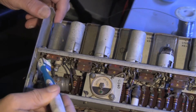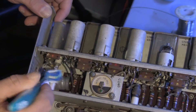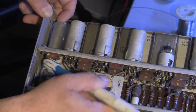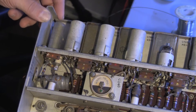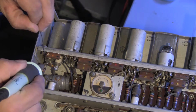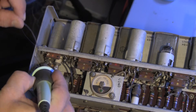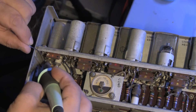I'll start by cleaning some of the dirt off of the contact I'm going to solder on. There's no reason for that to be making smoke in my room. The secret to unsoldering components is to add more solder to start with. We will apply solder to this contact so that it's quite saturated. This will give my desoldering tool something to work with.